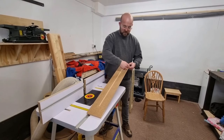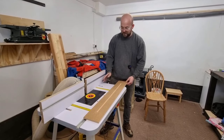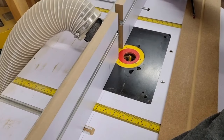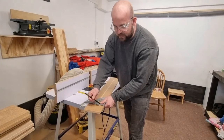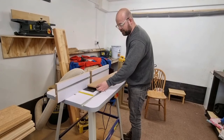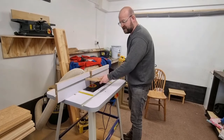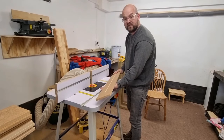Now I want to put a groove down each side of the board — left and right — now that we've done the centre one. I'm going to move the fence to the secondary line. I just square off to make sure I stop at the correct place each time. The good thing about this is all we have to do is place the board down, do the groove, then spin it over, place it down and do the groove again — and we'll have a groove on each side without needing to move the fence again.